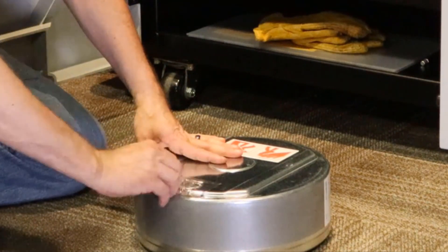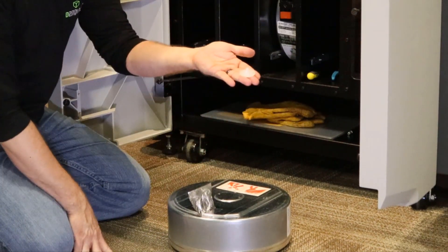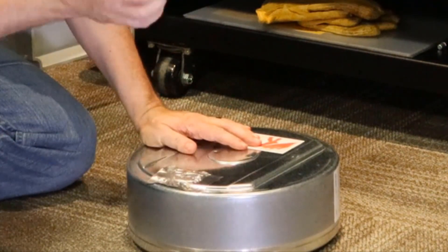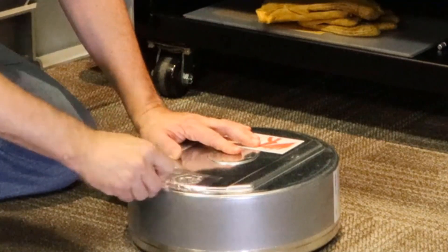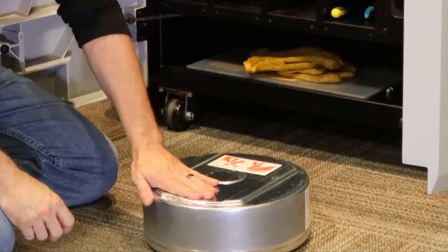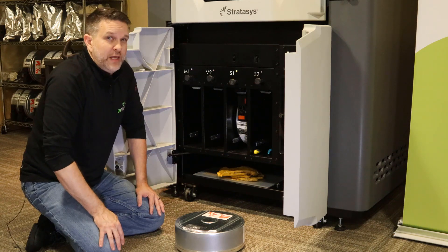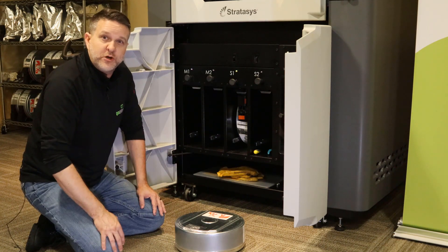You're going to need to take this tape and peel it up, pull that small plug out. Once this plug has been removed, you want to reseal that tape. One of the old tricks I've found over the years is to take that plug and actually use it as a flattening surface to adhere that tape back down. We want to make sure this is secure so that we keep moisture out of these material canister bays. Keeping them dry is really going to be critical to your success building parts throughout the life of whatever material you have.